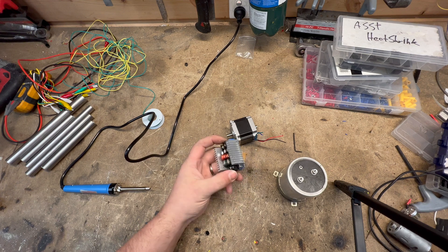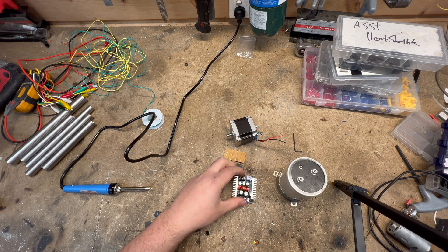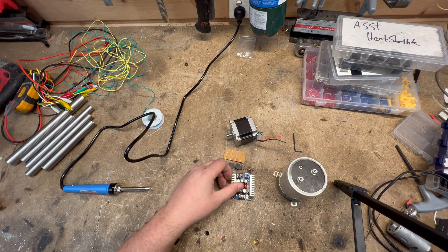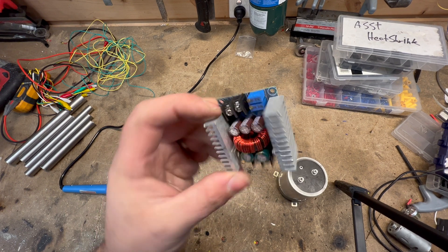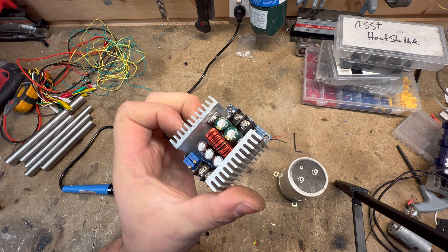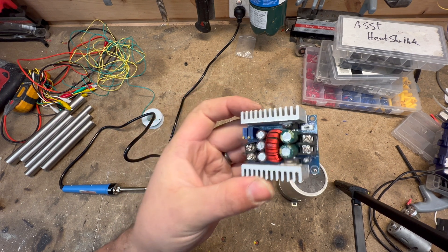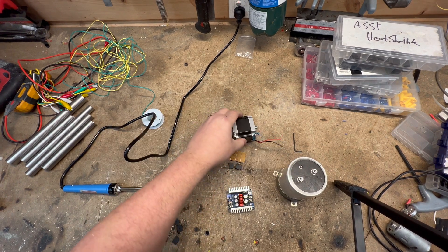If this is spinning really fast and making 60 volts, the buck-boost will reduce it down to 12 volts. If we're making 60 volts at 1 amp, that's 60 watts, so when we reduce down to 12 volts we'll end up with about 5 amps. These converters are not that efficient — any time you see a giant heat sink you can assume it's pretty wasteful because it has to burn off heat — but in this case it should be good enough. That's the basic circuit.